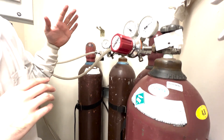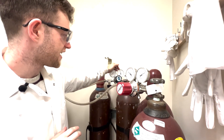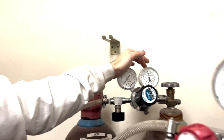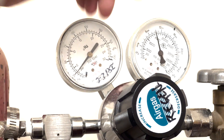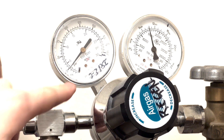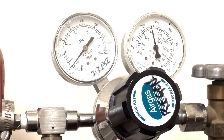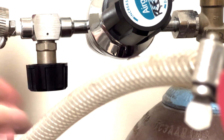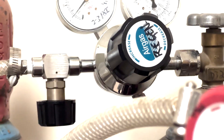In the regeneration cylinder we want to have a decent amount of pressure. The regeneration always takes about a thousand, so we have about 1500 in here which will be plenty. On this side it should normally read between 2 and 3 psi — it reads just a little bit over 3 which will be fine. Make sure that this knob here is open, which it is. That's our regeneration gas connected.